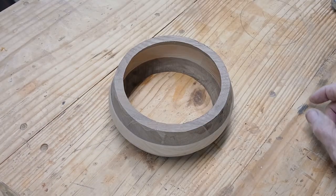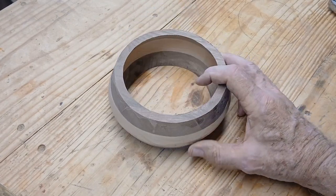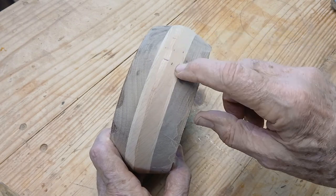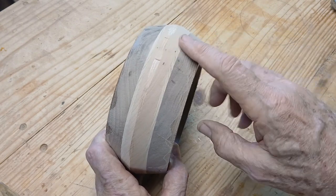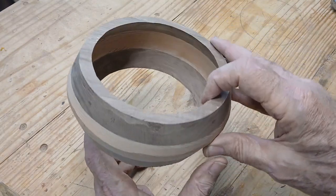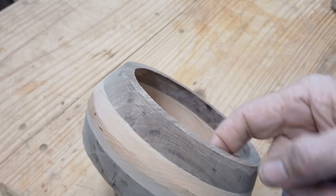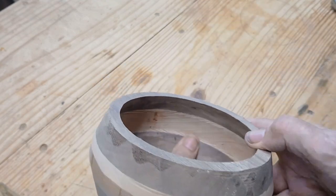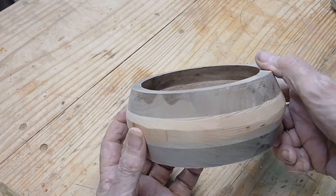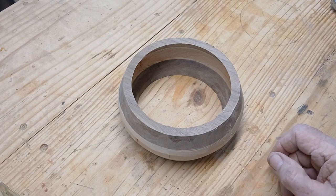I've got the center ring and the two adjacent rings glued together. I went to my belt disc sander, set the table at 20 degrees — it stuck out about a sixteenth of an inch on both sides all the way around. According to her directions, I sanded them down until they matched all the way, then went inside with an inflatable ball sander and matched those rings there. We've still got to glue the rest together and do some sanding and matching after that. It's coming along very well, I believe.